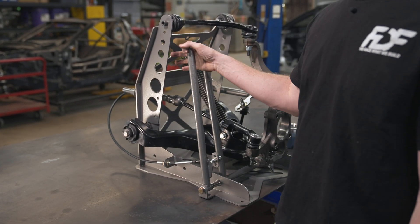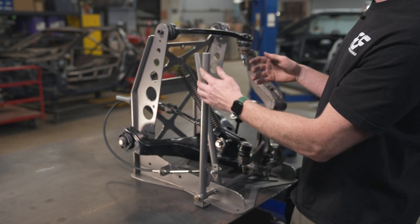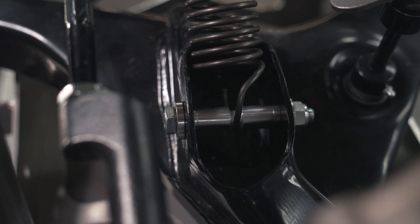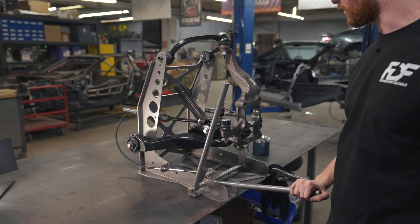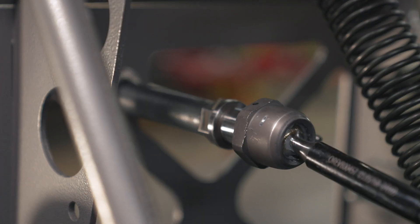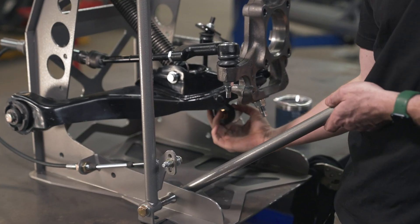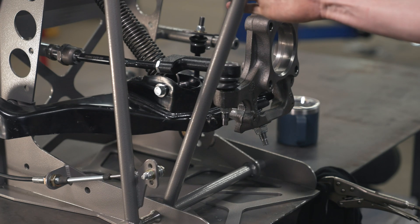I might actually throw a small scale gauge on this to tell how much force it takes to move it. The second thing is the travel, which is this handle. This assembly weighs 48 pounds, so I sized up the spring to reduce the amount of effort required. Something I didn't actually design for but is a really nice feature is a kind of park setting — you put the handle all the way down and it holds at max compression, so you can articulate the suspension and turning when it's all the way up and when it's all the way down. The Delrin wheel we machined runs along the bottom of the control arm and creates a nice ratio where it's hard initially and then gets quite a bit easier as you get higher.